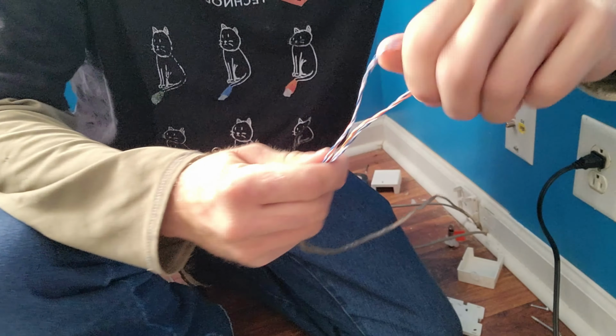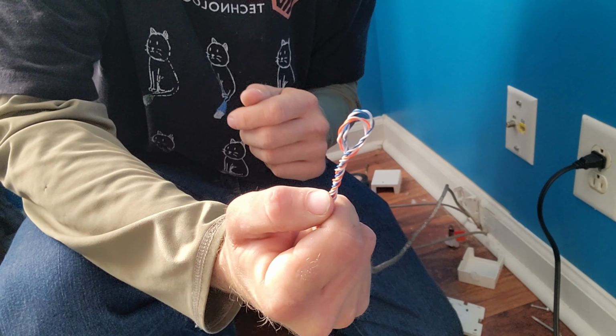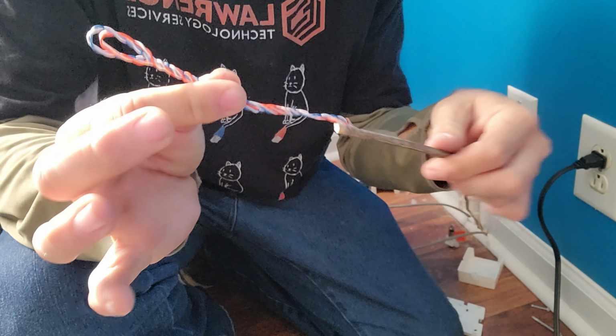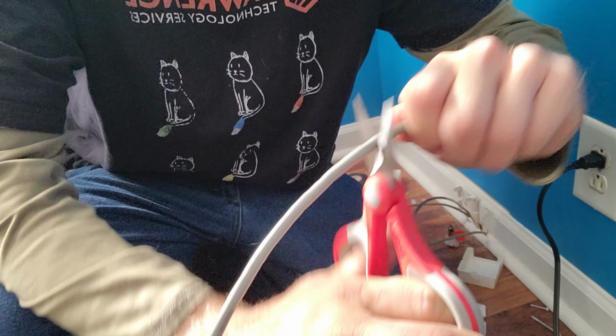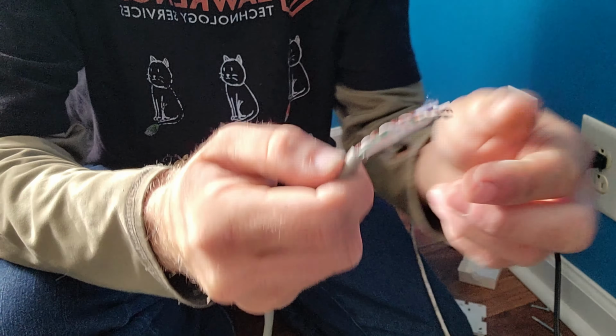And then I'm going to do the same thing to the other wire, but I'm going to run it to, you leave a little bit of a hole here, if I can camera work. And then at the bottom here, it's kind of hard to see, but you got that, and then you just tape up this part. So on the Cat 5e, not Cat 5, on the new Cat 6 that I'm running, it's hard to see. I don't think you guys can see that. There it is. It's hard with the stupid air, or the window. But anyways, I take my snips, score it, pull it off, and then you find your pull string in here.